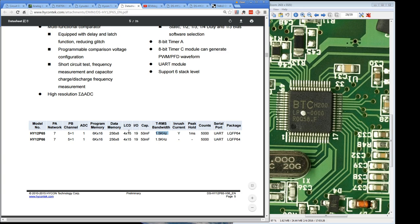I'm not sure of the specs because the BM235 has true RMS, but it's only spec'd up to 440 hertz. It can go beyond that, but I do know for a fact that it does actually die and do weird stuff beyond 1.5 kilohertz or thereabouts. I think I measured it once, and it did do that. So it's stacking up pretty well.